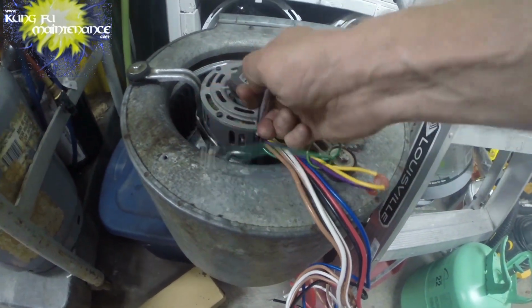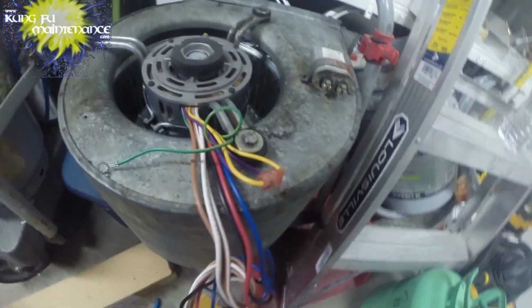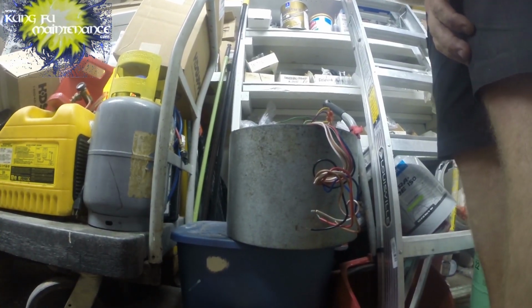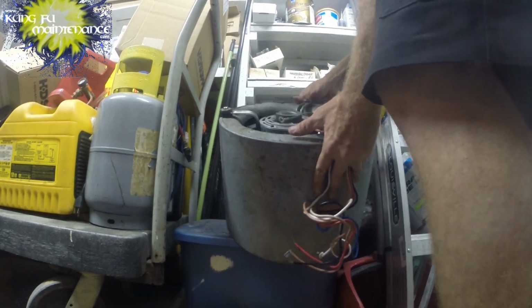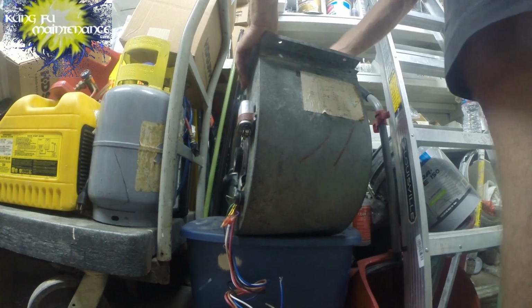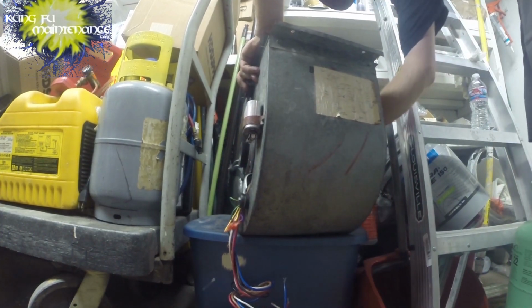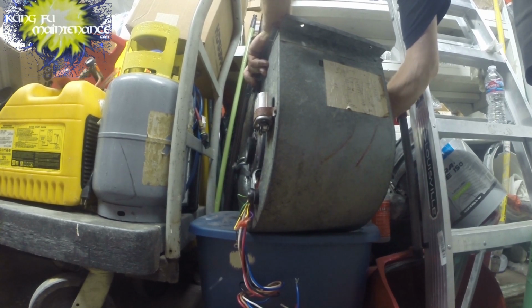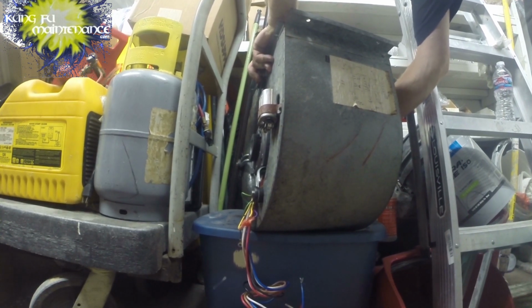So long story short, once hooking it up, of course the motor ran at too low of a speed to be effective for air conditioning. So the long story short is you can't use a condenser fan motor to replace an indoor blower motor unless it's rated for 120 power or 110 power. Anyway, hope you found this video helpful, and hopefully there were a few other things that were interesting that made it worthwhile.